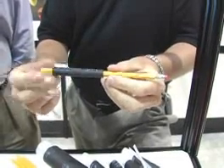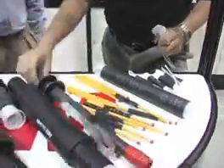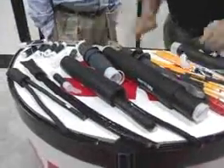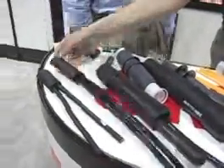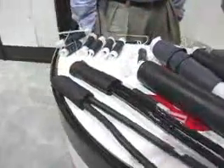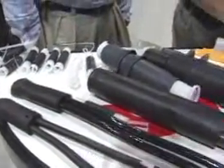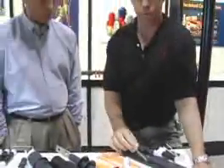It lands right onto your cable, and we use this technology for terminations going all the way up to 69 kV. We use it for splicing. Over here we have our new 5 kV motor lead boot. So we've got a lot of new insulating technologies, ranging everything from cold shrink and heat shrink. Cold shrink's definitely something that a lot of people still today aren't that familiar with, and we're very excited to constantly be reintroducing it to the marketplace. You should be — this is really exciting technology.